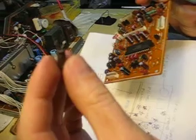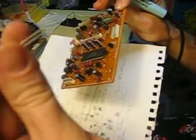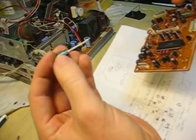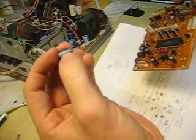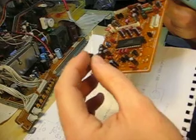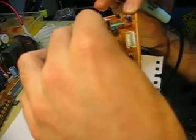This is the removed capacitor, and here's the new one. On new capacitors, it usually has a band on the negative side — that side is the negative. You'll also notice that the legs on there — the longer one — is usually the positive. So that's another easy way to tell.